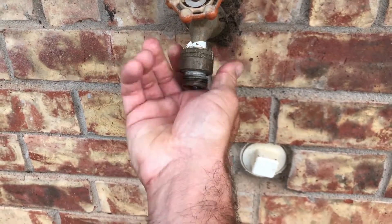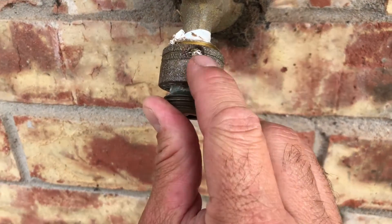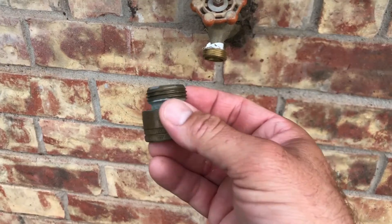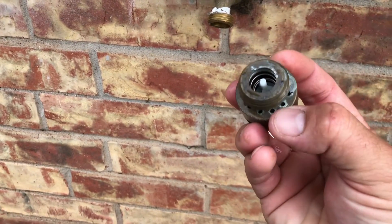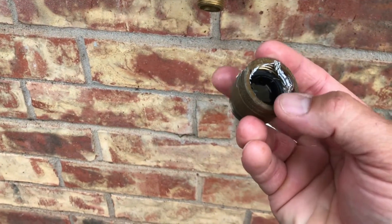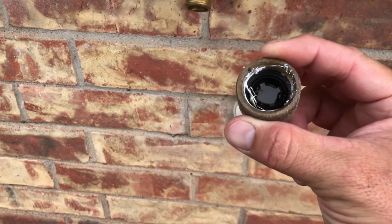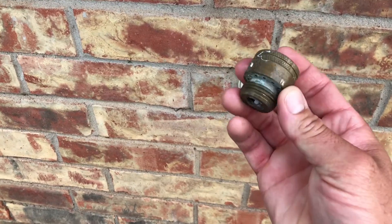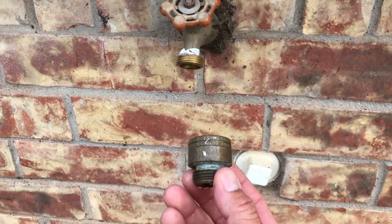I'll take it off here — I kind of loosened it so I could get it off. They have a set screw that puts it in there, and when you tighten it on there it'll stay on. This is what it looks like — see the little holes there, you can see a spring. I had some Teflon tape on there. What this is designed for is a backflow preventer, so it keeps stuff from going backwards back into your water supply.